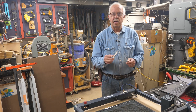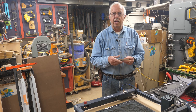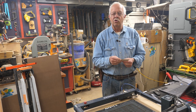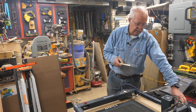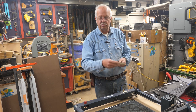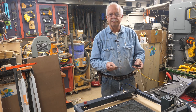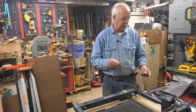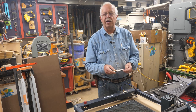Just a quick little video to show you how to eliminate what they call flashback — where you end up with a bunch of scorching on the back of your project when using a honeycomb board. You'll really know you're getting it if you start hearing that pop pop pop while it's cutting. You just need to raise the honeycomb board up a little bit between the protective sheet underneath and the honeycomb board. We have these five-millimeter riser deals for sale on our website — link in the description — along with the mounts and risers for the Longer V1 laser. You don't have to use these; you could use quarter-inch plywood too. But they're handy and you could use mounting squares to keep them in place. Hint: how to avoid flashback. If you got anything out of this, appreciate a thumbs up — it always helps the channel. I'm Roger, in a very messy shop. Thanks for watching, we'll see you in the next one.